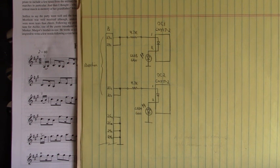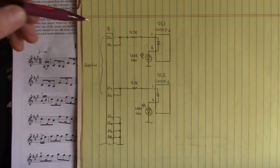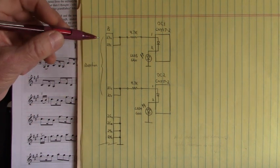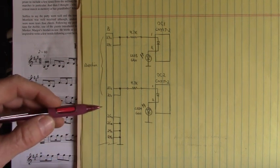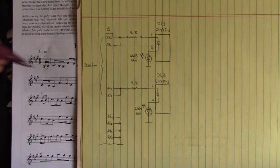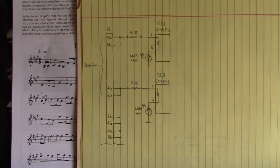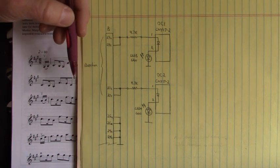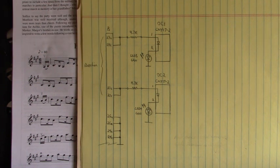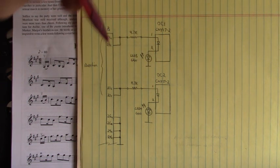Here are the direction inputs. One direction on 27A and 27C, and the other direction on 29A and 29C. So let's call this one clockwise and that one counterclockwise. Here are the grounds I was talking about on 24A, 24C, 26A, and 26C. We have two optocoupler inputs with 4.7 kilo ohm current limiting resistors. So I used an input of plus 24 volts DC from another external power supply on either 27A or 29A, reference to these grounds.